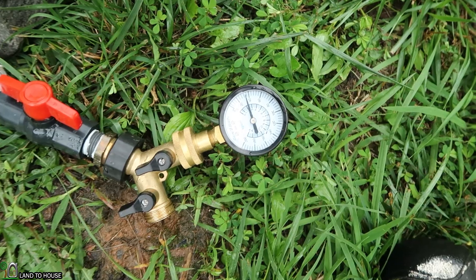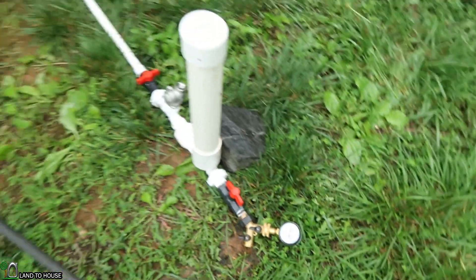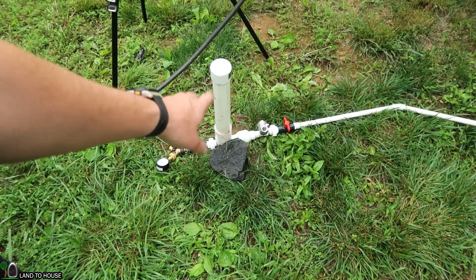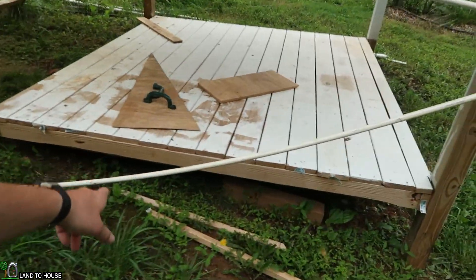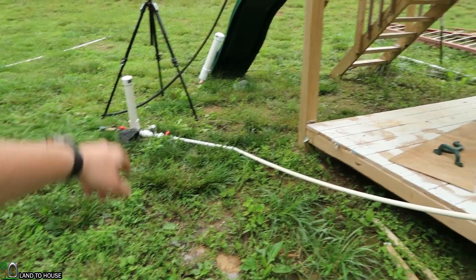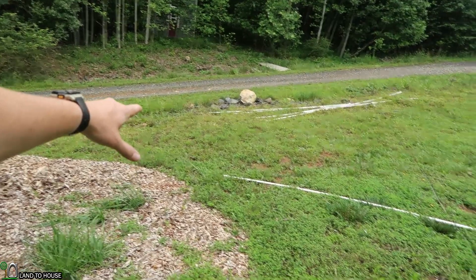The pressure is exactly the same — it may be about one less, but basically the same. My prediction was actually half right. The cycle time slowed down, which was actually better because we want it to be at one a second. The pressure was less, but there may have been something else affecting that. There seemed to be more bounce in the drive pipe on this lower section than there would have been on the straight 20, and that may have actually reduced just enough to lose that extra little bit of psi. It shows that yes, you can have a very low profile drive pipe and get the head pressure you need instead of having to extend it way out over 20 foot.